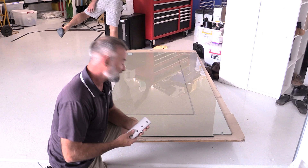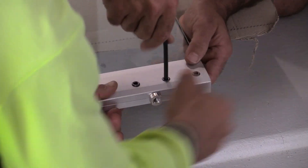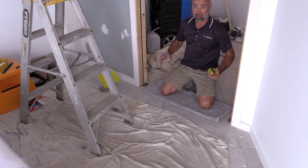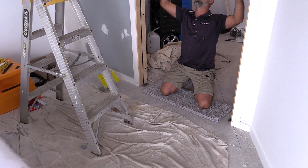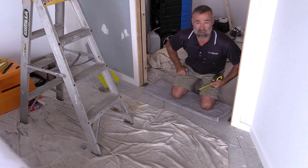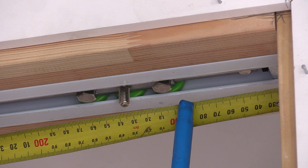Now that the cavity's in, the last part is installation of the glass door. We've got these heavy-duty brackets that attach to the top of the glass - I'll screw those on, carry it upstairs, put it into place, and then adjust it. A couple of quick tips before bringing the glass up: pack the bottom to where you think the door is going to sit. Being glass and quite heavy, you want to get this pretty close. Also adjust the track rollers close to where the brackets are on the glass, so when you lift it up into place you can make adjustments without having to maneuver around too much. Lastly, adjust the bracket so it lines up with the glass - just loosen the two bolts, slide it across to where it needs to be, and you're good to go.